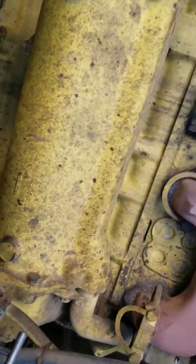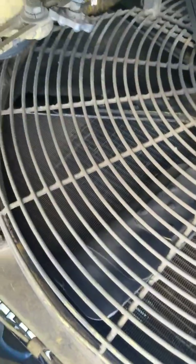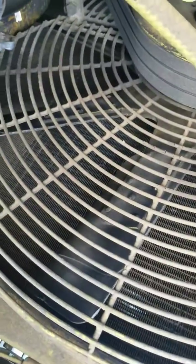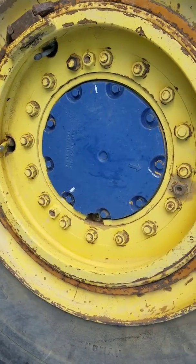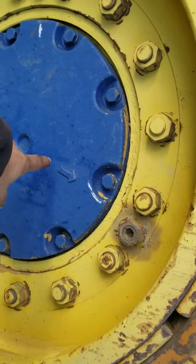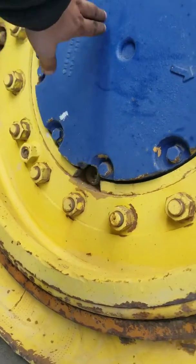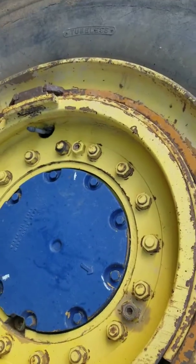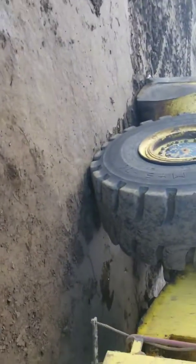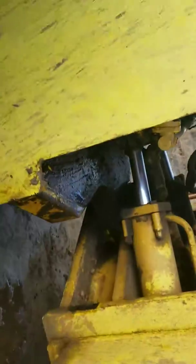A couple more things about Clarks: drain your air tanks in the winter or put an air dryer on them. Make sure your radiators are clean — these things always get plugged up with oil. This one has a pusher fan, and any small oil leak on the engine just blows it into the pan and makes a mess. If you're new to Clarks or wheel loaders in general, they have final drives or planetaries — check them. On this one, level the plug out with center and verify there's oil; you can reach in and touch it. You can put 50-weight or 80-90 gear oil in these.